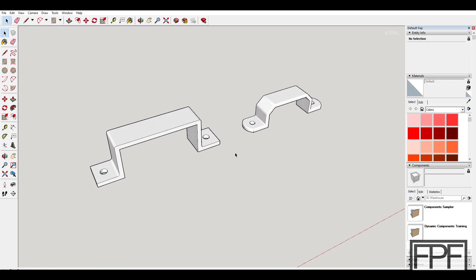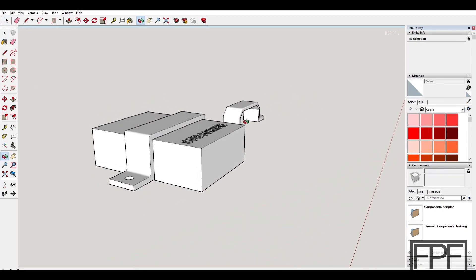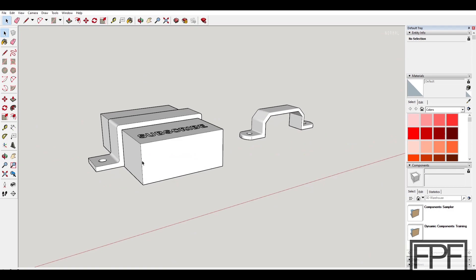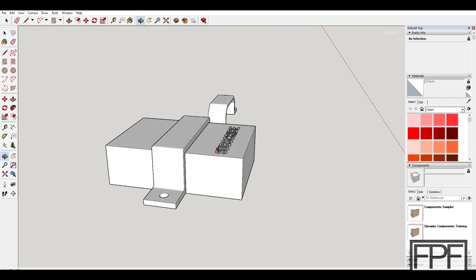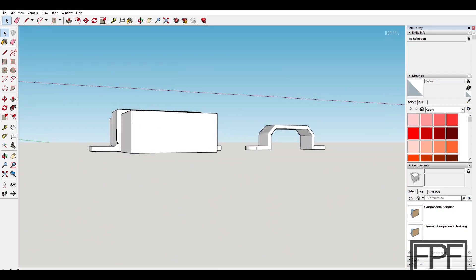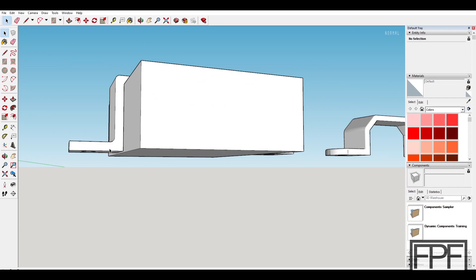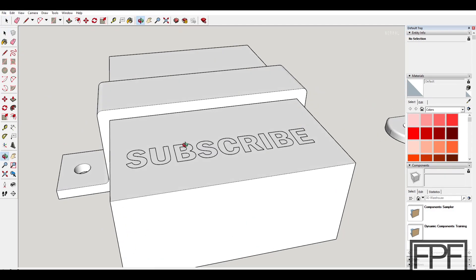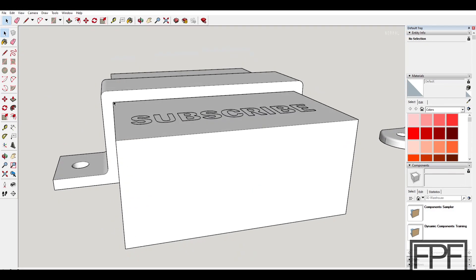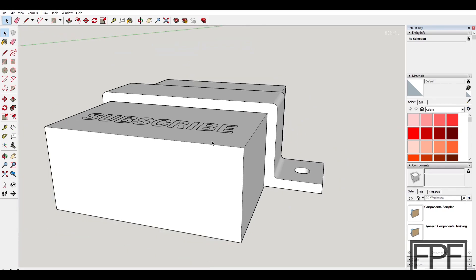Once you've got your measurements, the first thing you want to do is draw the object you're making the mounting bracket for. This is a stand-in for that TP-Link power over ethernet adapter. By drawing it first, not only do I get a sense of scale and know how big I want the mounting strap to be, but I can also draw the one face of the mounting bracket right over the object, giving myself that little bit of gap between the bottom of the mount and the object so it snugs up on the wall. I would leave about 0.2 millimeters on both sides since your 3D printer is not going to hit that tight corner perfectly.